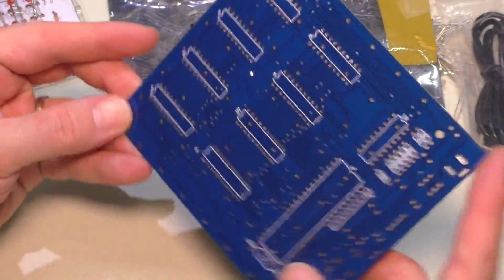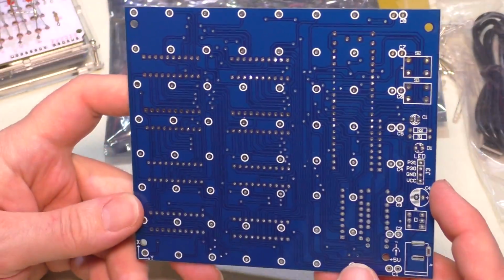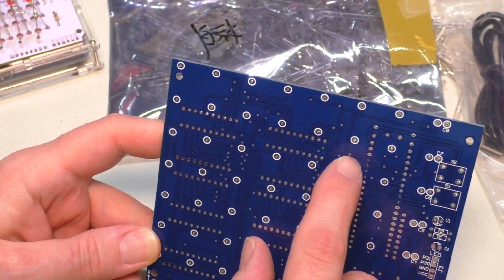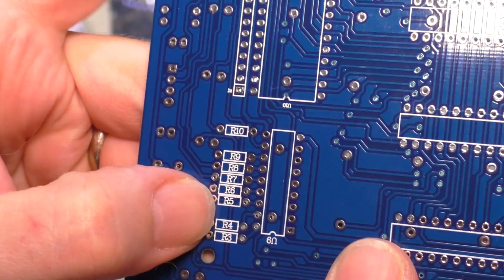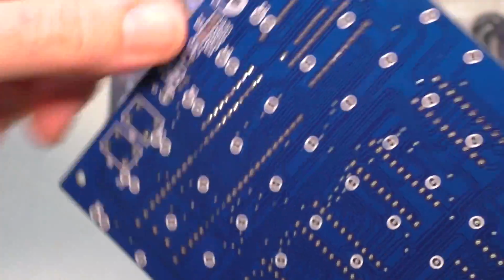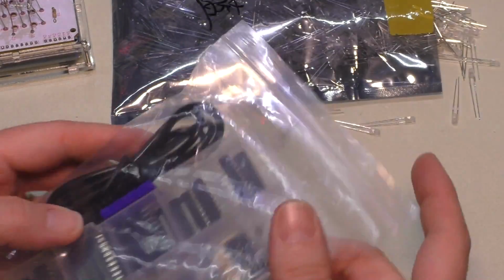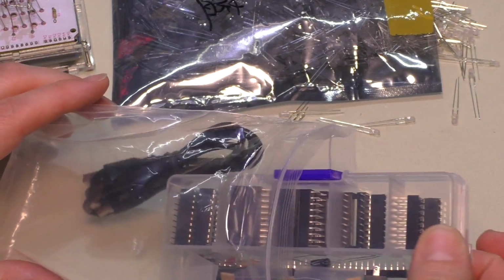But this board has to be built in sequences, and we'll get into that in the next video. But what's nice is they give everything kind of already laid out here where it's going. And if I get close enough here, and hopefully the camera will zoom in, we got the component values, not what belongs there though. So I can tell you, hey, this is where R5 goes, but I don't know which resistor R5 is. So we have to use a process of elimination. Although it should not be hard to do, because as we look at the rest of the parts here, there are only so many pieces and they only go in so many positions.